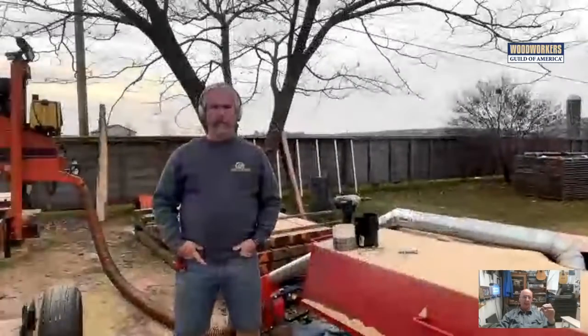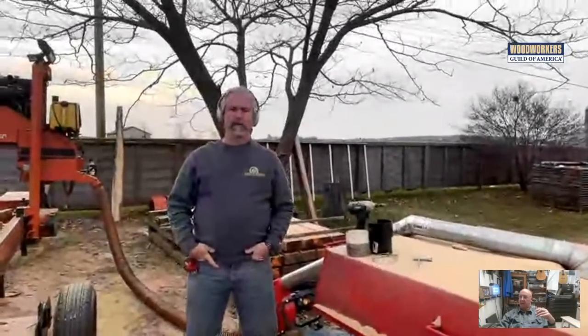And then I'm going to come back to our kiln versus air drying with this. A very good friend of mine was a carver, and he would only use air dried basswood, not kiln dried basswood, because he said the kiln, just like we talked about with color, would bake that wood and make it harder. So even though both are dry, the air dried basswood was way more malleable and easy to work with. And I know for people who are doing a lot of steam bending, they prefer to do that with air dried than kiln dried for the same reason that you have a piece that's way more workable. Even though they're both dry, the air dried is way more workable.